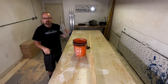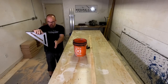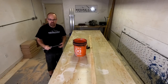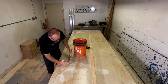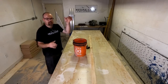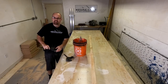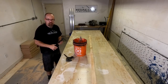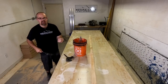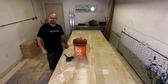Finally, don't forget your speed square. When you want to find the center point of the sink, line it up with the cabinet doors and trace the center point. It also gives you setbacks — for example, if there's an existing backsplash in place, butt the speed square to it and measure its thickness from the wall. Also bring squeeze clamps or spring-loaded clamps to hold things temporarily. We like the rubber-tipped ones since you'll often have brand-new cabinets in place that you want to protect.